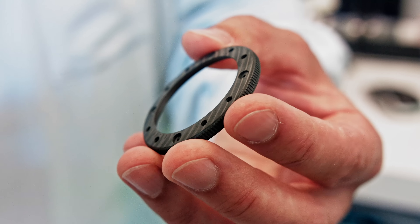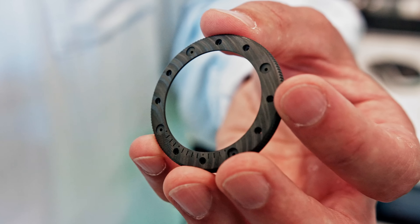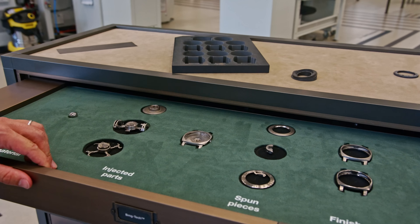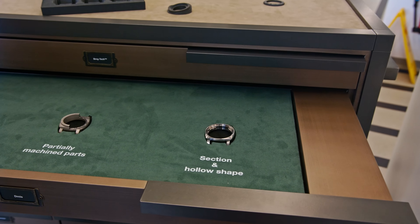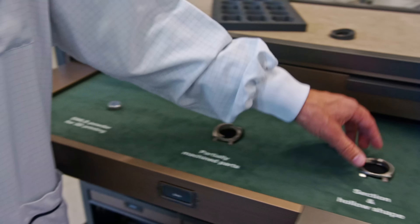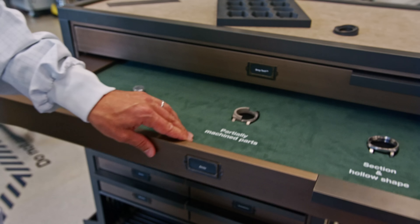It's not only Carbotech — Panerai has many other unique high-tech materials. For example, BMG stands for bulk metallic glasses: a super-strong amorphous metal glass material. There is also 3D-printed titanium, where the part is first printed with a hollow structure to lighten it, then re-machined so you cannot see it was 3D printed, but it is lighter than the original version. It's always a pleasure to see ideas taking form into a product and observe what needs to be optimized.